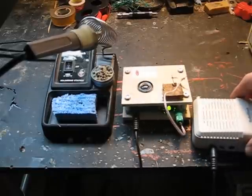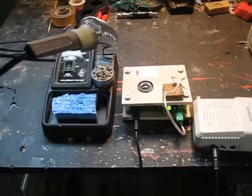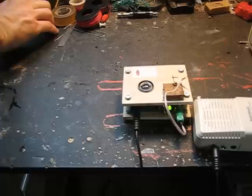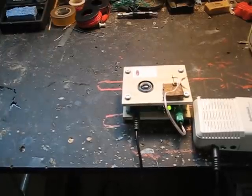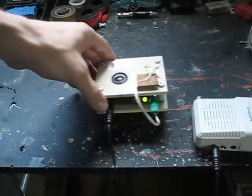I've placed a fresh cockroach leg on my spiker box, but what is that dreadful humming? That humming you're hearing is the 60 Hz line noise running through all powered equipment plugged into the electrical sockets in your wall. So I'm moving the soldering iron away from my spiker box and turning it off, turning off the fluorescent lights, as well as turning off all powered appliances plugged into the wall around my desk.